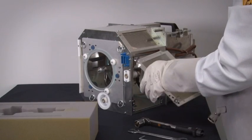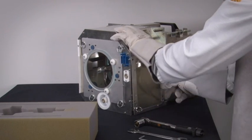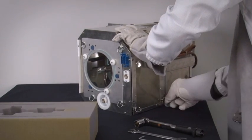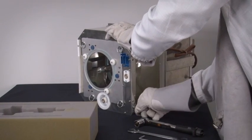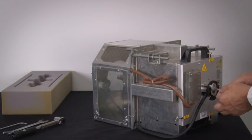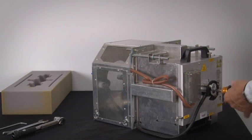Place the side cover back onto the lamp house and tighten the two retaining locking thumb screws to secure the side panel. Insert the cathode bolt back into the rear of the lamp house with a 5 mm torque wrench and tighten to the proper torque specifications.